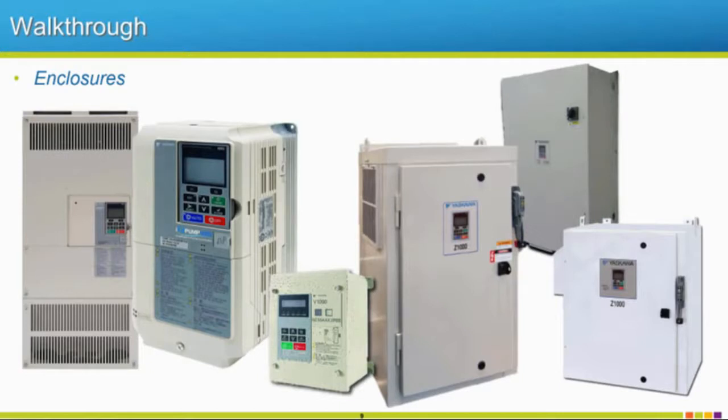Their uses could be anywhere from indoor use with a light degree of protection, so maybe there's just a little bit of dust, but a fairly clean room that this drive's located in, all the way to maybe it's for outdoor use on top of a rooftop in the middle of summer in Texas or a winter in Chicago. So just varying degrees of enclosures, so they change a little bit depending on what kind of environment you're going to locate them in. And some of these even have hose down capabilities, so you can spray them down with a hose like the NEMA 4X.